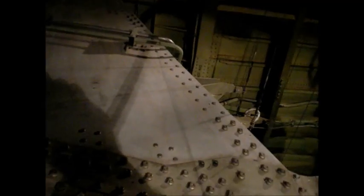There's the power feeder cable again. Those are fitted in one piece — you don't splice those. We've got three of those on the airplane: one from the APU and one from each engine on the wing. They run from the generator all the way to the power distribution panel in one section.